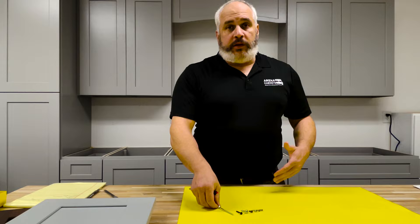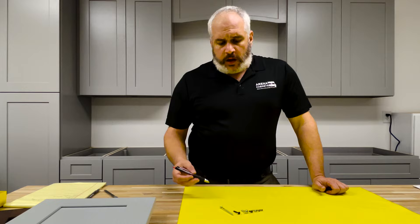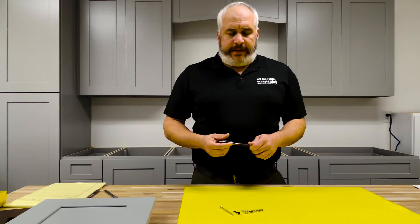The next one is an inch and a quarter drywall screw. Basically that's something we use here in our shop for the backs into the bottom shelf — it kind of tightens up the cabinet and keeps that quarter inch panel nice and tight to the back of the cabinet.